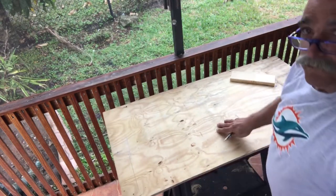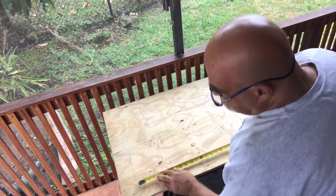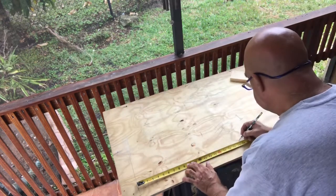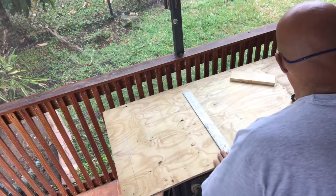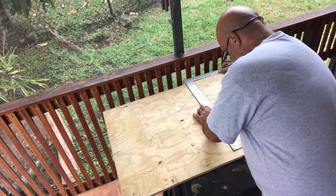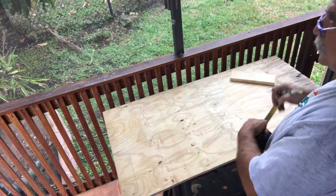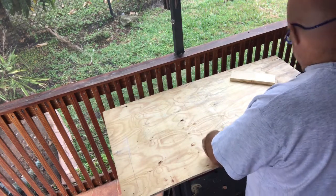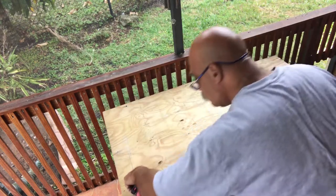This is the template of the one door for the arch. Now what we're going to do is find center. I mark center so I know exactly where it would be. It's not that critical as long as you take the measurement and know how much wood you need to get around that arch. I like to mark center and then I can measure and get exactly what I need to cut that plywood. This measurement happens to be 44 inches, so the length of my plywood will be 44 inches. The width is about 7 and 5 eighths of an inch, so I'm going to use this Bora tool to cut it.